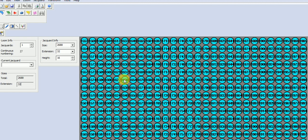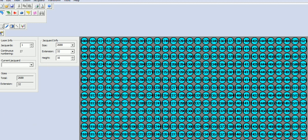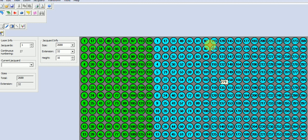But in this loom you want to make 84 ends per inch. How can you do that? Cast out. All these hooks are running at 168 ends per inch. If you want 84 ends per inch, which is exactly half of 168, you can leave one after one. It means you can draw ends: the first end will be drawn, this will be the second.